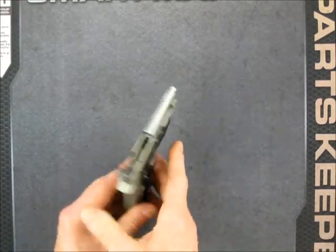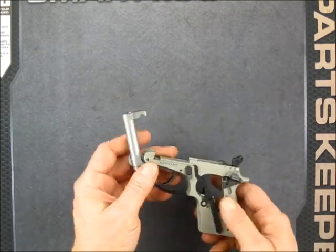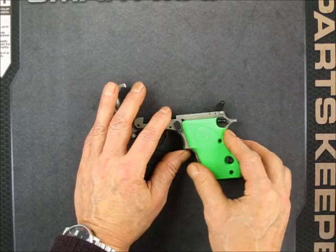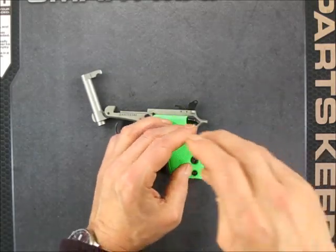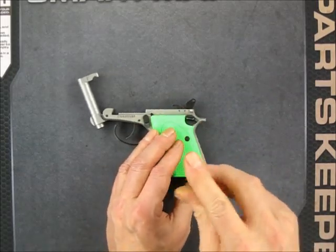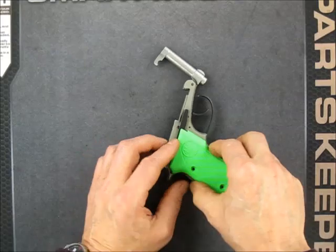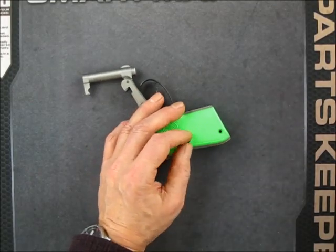There it's in. So now we can put the grips back on. I don't know if there is a direction to these slide spring levers — I don't think so, they look to be stamped parts. One side is kind of rounded and one is a little more sharp, but they're both the same so it's not like there's a left and a right. But you can see there are wear marks, and I think those wear marks were against the frame, so I'm going to put them in with that wear mark against the frame.